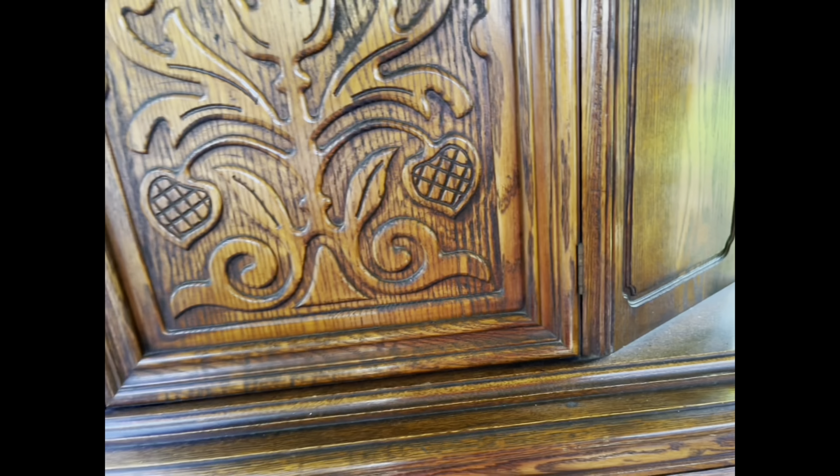I have my second coat of oil-based primer on my buffet and I've taped off all my edges, so it's ready for paint. Here on the china cabinet it's been taped off and I have my first coat of primer. I also made the repair here on the side. It's drying and I'm going to give it about 15 minutes, sand it back, add a second coat of primer, and come back when it's time for paint.